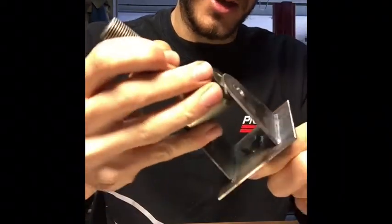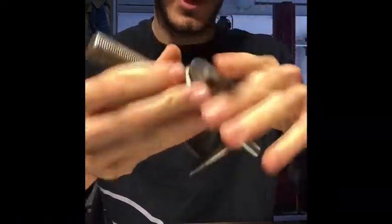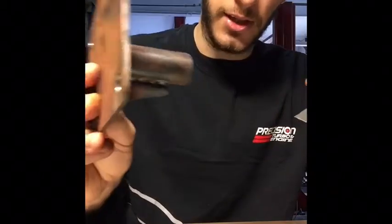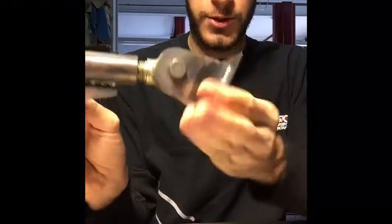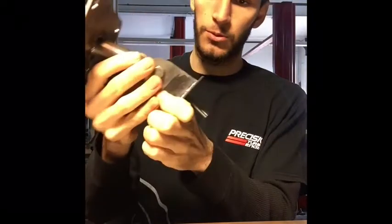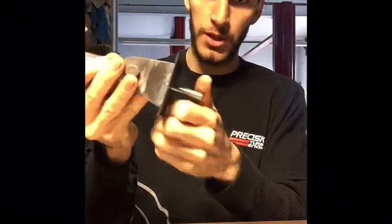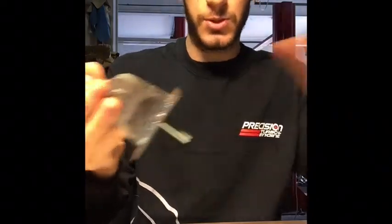Here's how it works: you get a threaded rod end, put it in there, get the bolt, and bolt it up. The motor mount bolts onto the block itself — a nut will be welded on here and this will be threaded so you can adjust it up, down, and set your degrees. Mine's at 42 degrees, so when I weld it in permanently I have to make sure it's at 42 degrees. This slides through the factory clamshell mount and you bolt it up right there.